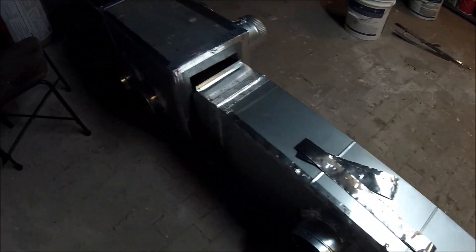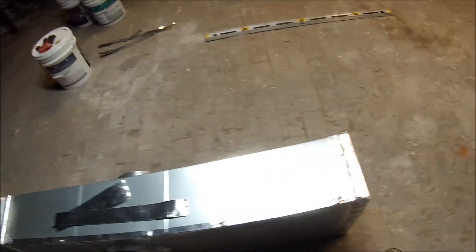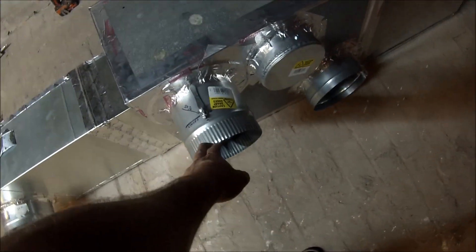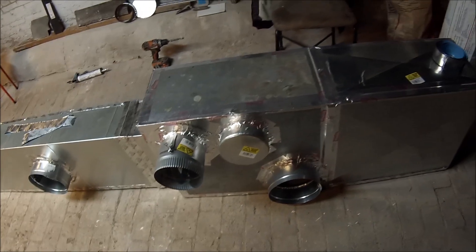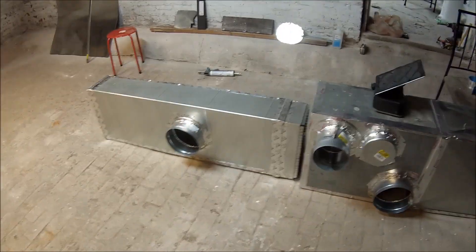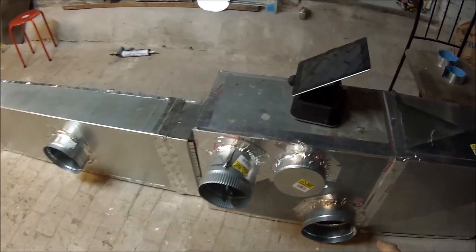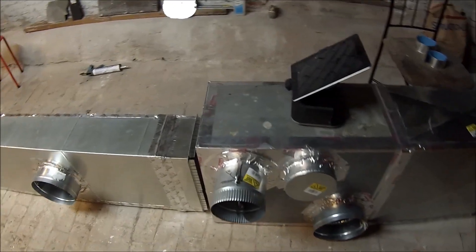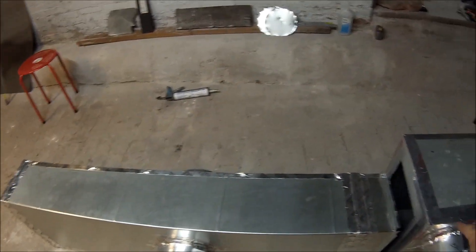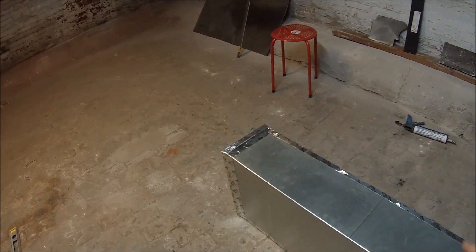I've got my two vents here — closed off one that was a little too close. On this side I've got one for the bathroom and one for the bedroom. I closed off another one because I could use the other instead, wanting at least 18 inches on center as HVAC school recommends. This duct system now has 24 inches off the heat exchanger, 18 to 24 inches off center from the staggered takeoffs, 18 inches off the transition, and 24 inches from the end cap. That's a correct system.